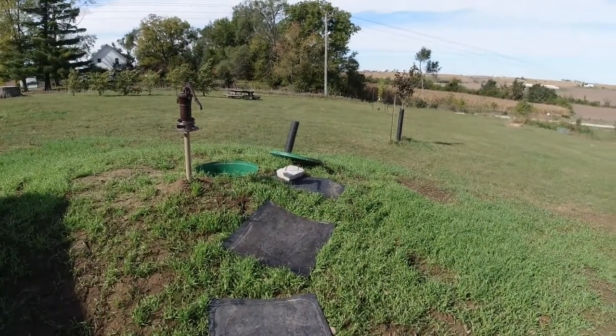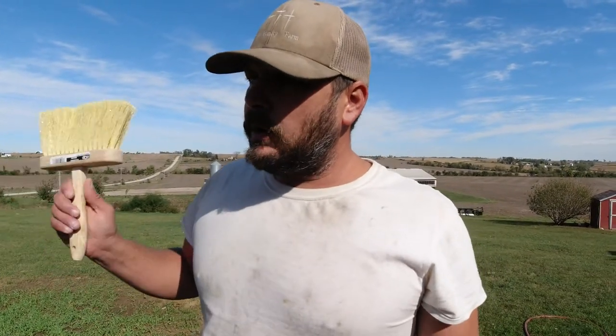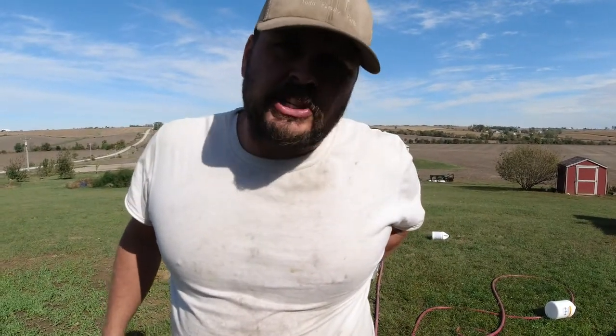This is the cistern, part three. We're putting the final touches on it. As you can see, we've got it seeded and we've held the dirt, trying to get some protection going into winter and early spring. It was a challenge because the chickens kept scratching, but we're getting enough dirt there. Now, I filled up the cistern and we ended up having it leaching at a rate of one inch per day, which I didn't appreciate. That's probably doable, but we're going to go ahead and seal it up.